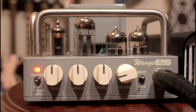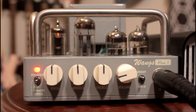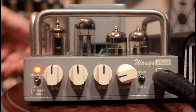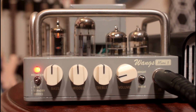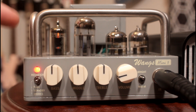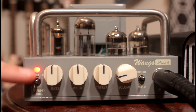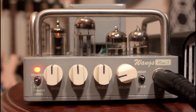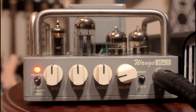Checking out the B cam here, there's a very simple control layout: you have bass, middle, and treble — a three-band EQ — and then an overall volume control. The master power switch is on the back of the amp. Then you have a three-position toggle: in the middle it's in standby mode with no output. In the up position you're getting the tube rectifier, and in the down position you're getting solid-state diode rectification. Over on the other side there's a two-position toggle for bright or warm.